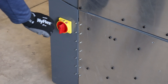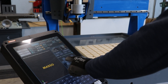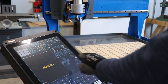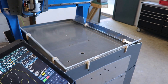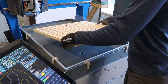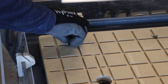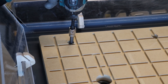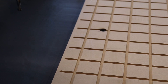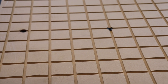Let's fire up the machine and start with some nice, easy wood cutting to test out the first work surface. The first step is to home the machine, and I've already referenced the zero with the back left corner of the working area. This is the first of three interchangeable surfaces for this machine. It is a vacuum top — I wanted to try using a shop vac as its vacuum source. We cut this ¾-inch MDF top on our 4x8 CNC, and it has the same bolt pattern as the machine. It also features quarter-inch wide, quarter-inch deep channels leading back to the table's drain hole, which will be connected to the vacuum.